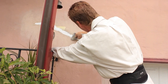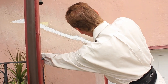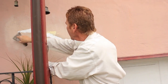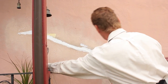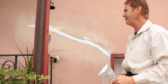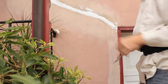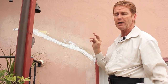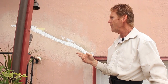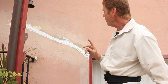This is the best caulking I'm aware of. Some of you folks might say you've got something better — if you do, that's great — but this stuff works for me. I rebuilt a big chunk of about 20 bricks on my neighbor's wall with this stuff 20 years ago and it's still holding. Will this caulking solve this crack permanently? No, but it's a good 10-year fix. It'll start again as a hairline and restart the process, but it's a cheap fix rather than tearing the whole wall off.